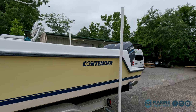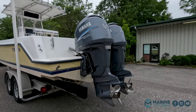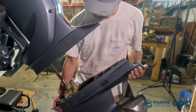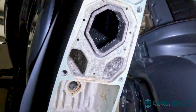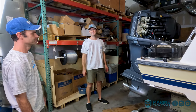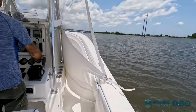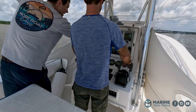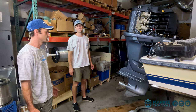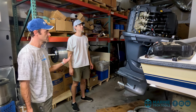The first thing that seems obvious is these are 2004 225 horsepower 3.3 liter Yamahas — great engines at the time. The primary concern with these is a corrosion issue in the midsection. Dry exhaust rot. So we're going to run these things. The boat does about 47.7 knots coming down the ICW at about half fuel, so we think we could have gotten 49 out of it. It's not going to be the most fuel efficient option, but it's definitely the lowest cost option right now. And they run, so we're going to run them.